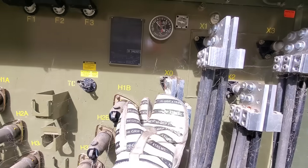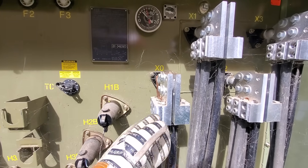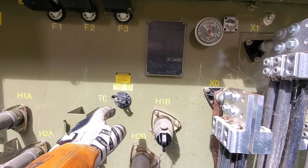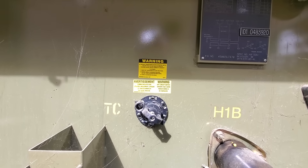To change the tap — say you want to increase it and maybe get 355 volts — that can absolutely only be operated when the unit is de-energized. That's why it says: 'Warning — off-circuit switch, operate only when transformer is de-energized.'